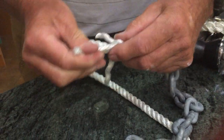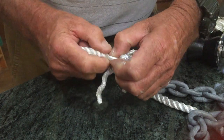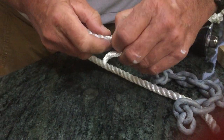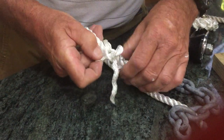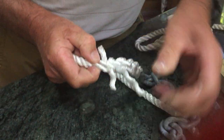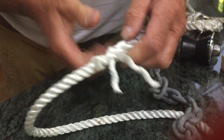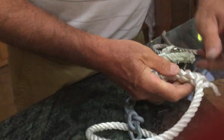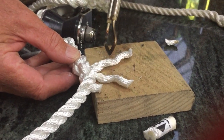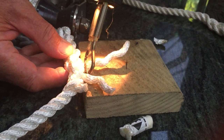This chain here — I can't remember whether it's six or seven millimeter diameter — it's probably the most common size chain that you would have on anchors on runabouts up to about 20 feet or six meters long. We're getting pretty short on the tails, so I'll make this last one here the last one through. Give it a bit of a rub to even it out. You can see they're all sticking out — obviously you've got a short one, a long one, and then the longest because the short one has gone a lot further up the rope than the others.